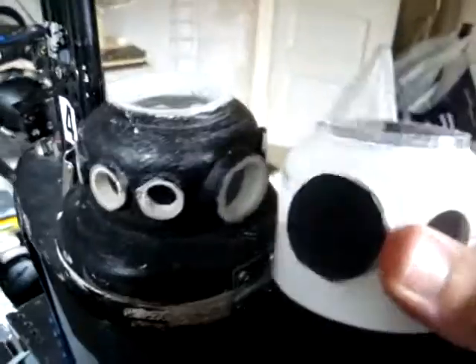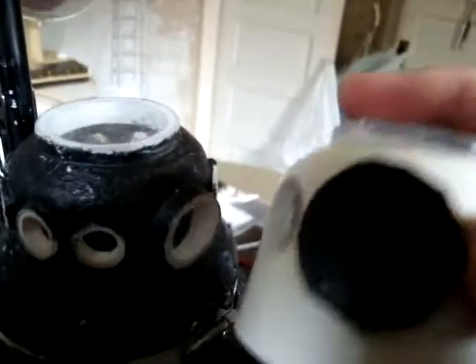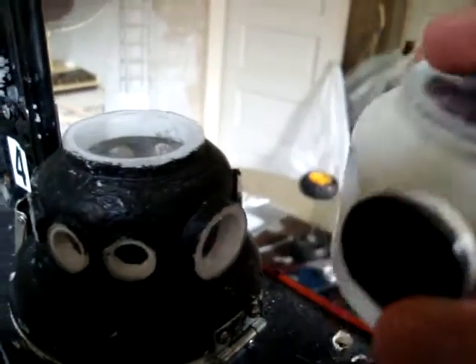I have salvaged most of the parts on this boat from things like computers and PVC. The pressure hull on this boat is only a six-inch thin wall — I'm hoping to get thick wall to make it a little stronger. I'm making another one of these plexiglass caps — a PVC cap that I've made some portholes for. I put tape on the inside to keep liquid cement from ruining them, because I'd have to start all over again.